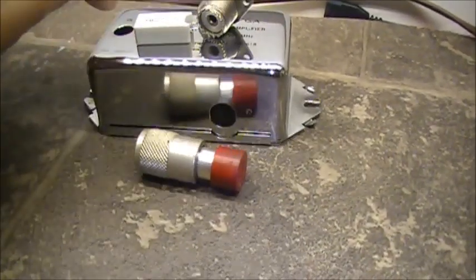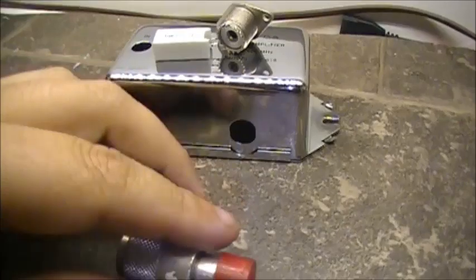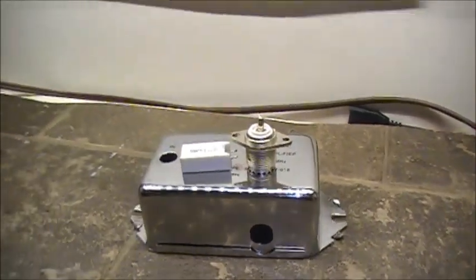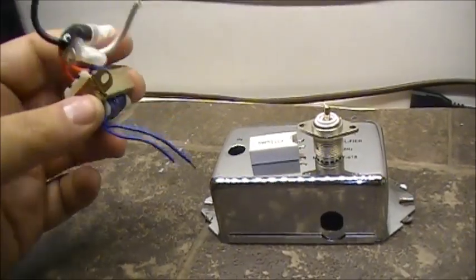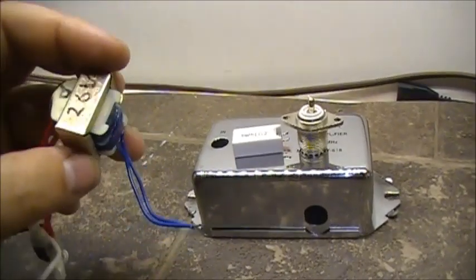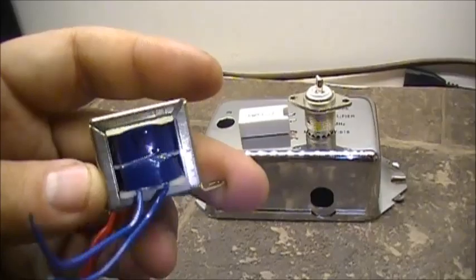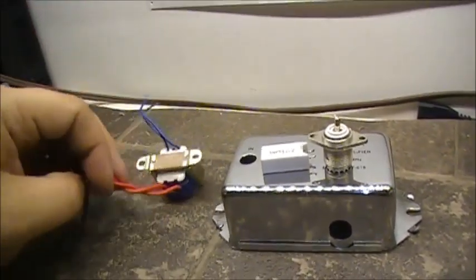A little 5 watt dummy load would be perfect for an AM CB radio. I'm thinking we're putting that inside this case - Brad gave me this one along with the black one that I built a preamp in. I was going to build a preamp into this one, but the transformer in it is 26 volts, and by the time you run it through a voltage rectifier and a diode, you're up to about 30 volts. I figured I'd save this transformer - it'll work on another project. I never throw away transformers; these guys always come in handy.